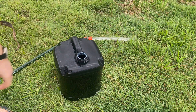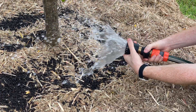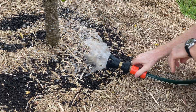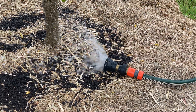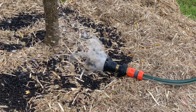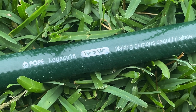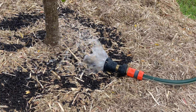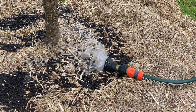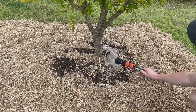You can read the comparisons online and everyone knows 18mm hose will flow more, but I've now tested it with my own pipes, with 30 meters of hose on my property. With 18mm hose compared to 12mm hose I get around one and a half times the flow, and for me that difference is worth it — it's just more convenient and costs me less time.